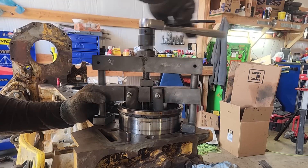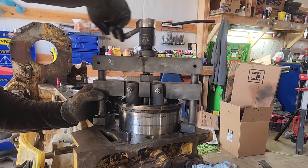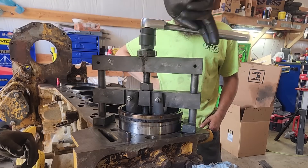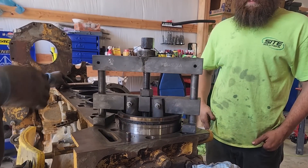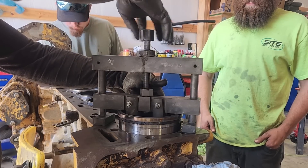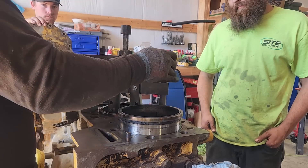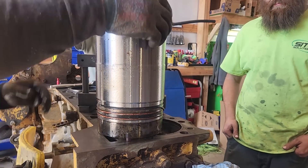It is not easy to pull the liners out — it would be pretty much impossible without this tool. The o-rings, which are more like rubber bands on this engine, actually hold them in quite tightly. I've even had cylinder pack pullers stop because the o-rings just wouldn't let them move. One thing you don't want to do, especially on the first liner you're pulling, is be underneath it because usually there's coolant in place. Put a pan under there because when you pull that liner out you're usually going to lose a bunch of coolant. Didn't lose much on this one, but there's the liner.